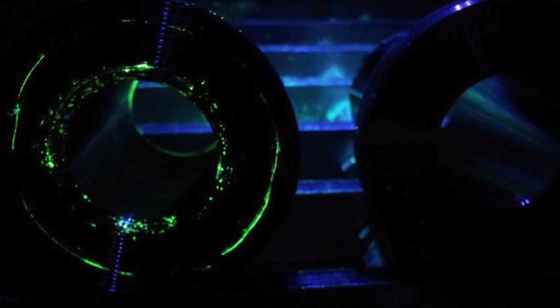After 10 minutes, we rinse the excess penetrant from the hose surface, dry the surface, and then apply a non-aqueous developer.